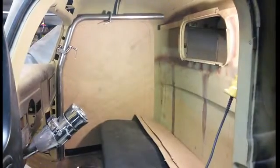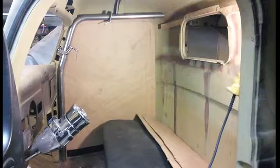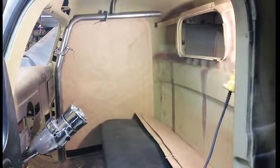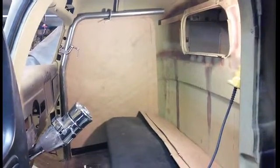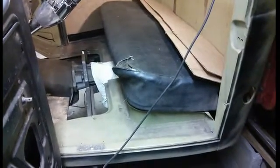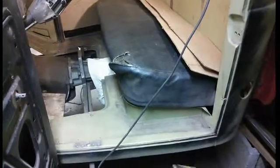Okay, you can see I took the competition engineering box, and I'm using the box as much as I'm using the rest of the metal. So I made a template out of that, and I have to get a piece with a 90 for the far side of the door there. And I'm going to put one of these hoops around each doorway, and then over in this area from here, I'm going to cut a hole all the way through here, put a piece of 2x2 square in, and make sure that it covers this body mount here and that body mount back there.